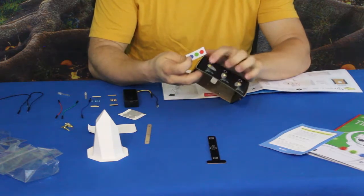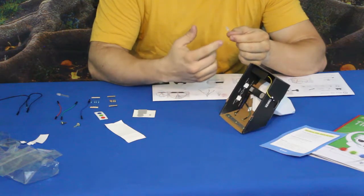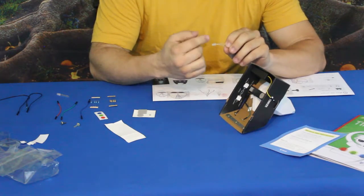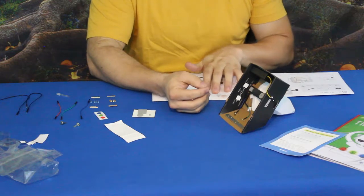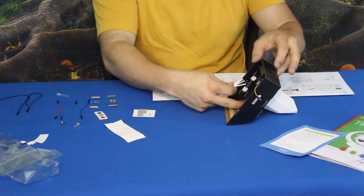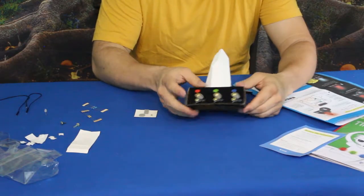The colors on the back also correspond to how the LEDs come out. Now, these LEDs have more than the standard two pins — they have four. That's because they contain all three colors (red, green, blue), and the fourth pin is the grounding pin. It tells you exactly how to connect them according to color, so make sure you pay attention to pin lengths and position when plugging in the different wires.